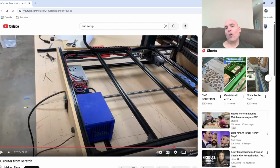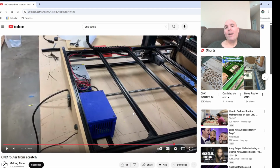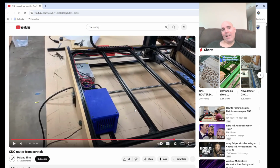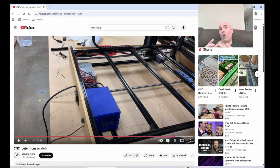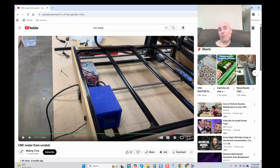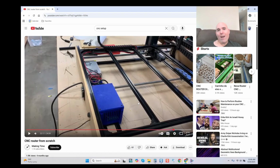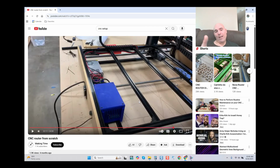If that's closed cell foam, which I'm 99.9% sure it is, it's made for packaging, then what you're ending up doing is suffocating your air volume. And he would know that if he put his hand on the outside when he turns on the unit. So yes, sir, while you are filtering, so to speak, by not letting dust get sucked in from that intake port, the other issue is you're suffocating the fan because the vacuum is gone. You have no more way to bring cold air or ambient temperature air into your enclosure.